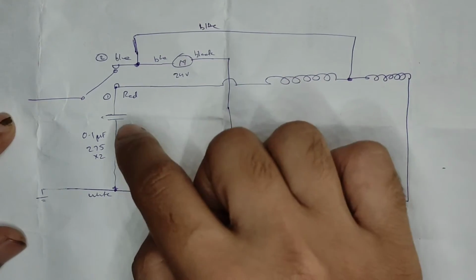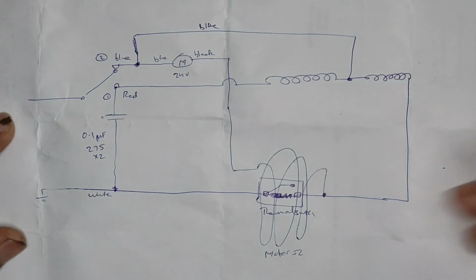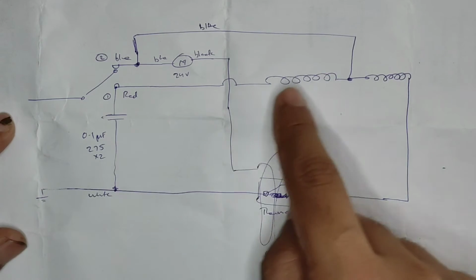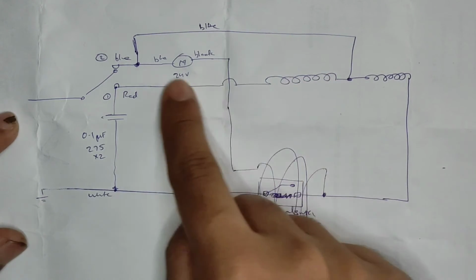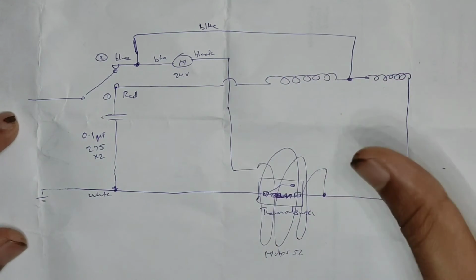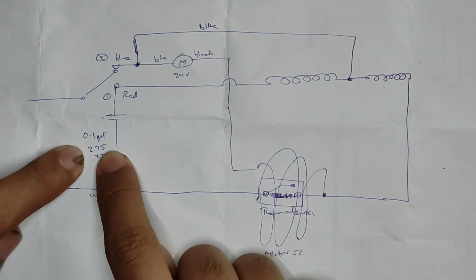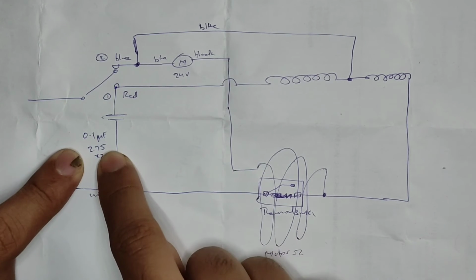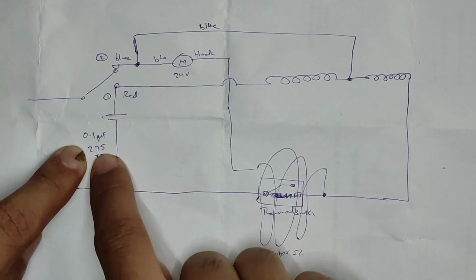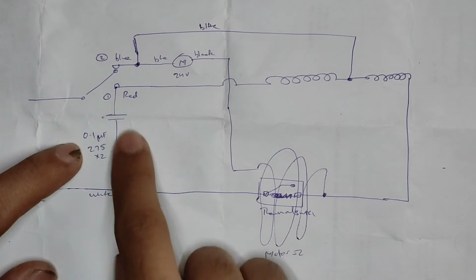So let's say this is a typical capacitor dropper power supply. Let's take an example for the capacitor dropper power supply. This is what they are using at the input side. So the same application is happening on this side, just to reduce the current down to a better, safer limit, just to get the 500-degree mark. They have specified this particular value capacitor, although the voltage rating is much lower. It's just 275 volts, which I don't recommend; you should always better use a 400 volt capacitor over here, but that's what they did, so I cannot do anything about that.